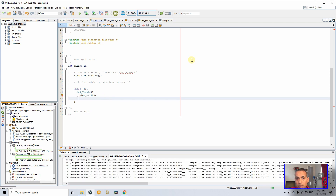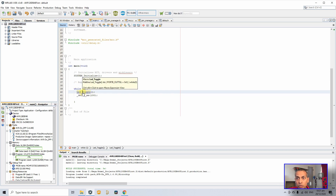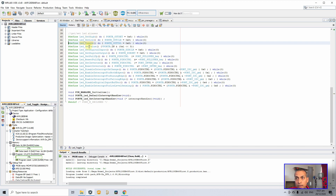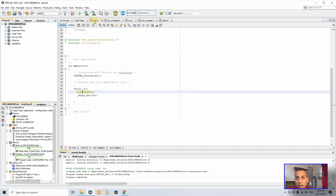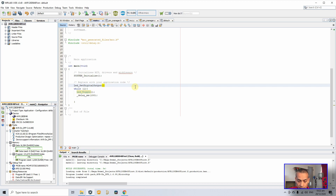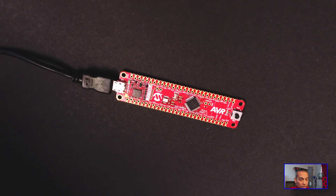Build succeeded, but when I loaded the code to the board it didn't work. It turns out MPLAB X IDE doesn't set the direction bit for this AVR device. We need to do it manually — go to the macros and find the macro that sets the direction bit to output. Use that macro just before the while loop. Build again and the LED is now flashing — success!